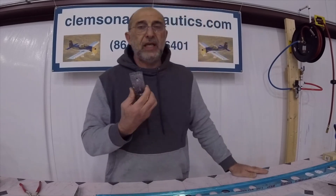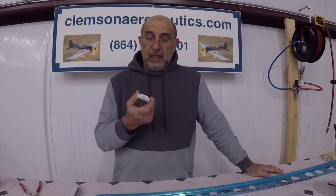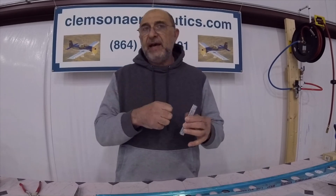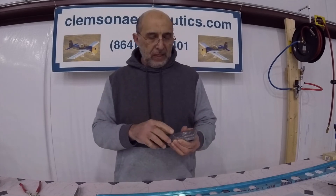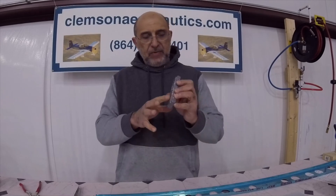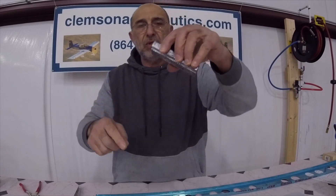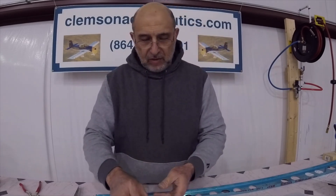Working with lead is different than aluminum and steel. Lead is very gummy and it tends to grab a drill when you drill on it. It's not perfect here — I have to knock this high spot off first so it would lay down flat in there. I think I will start on that tomorrow. We'll close it up for the week — I hope you guys had a great weekend. Thanks for watching; we'll see you next time.